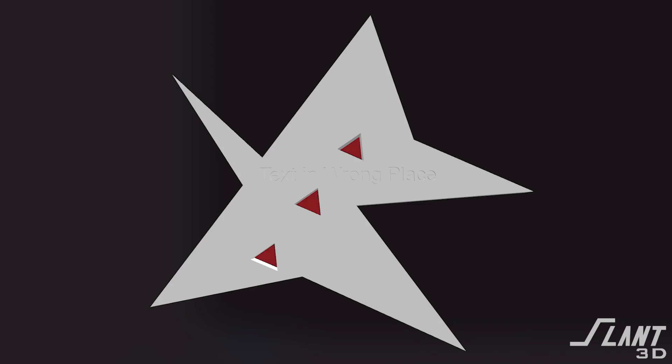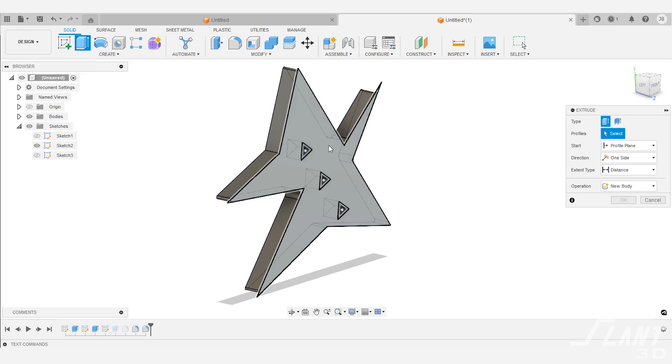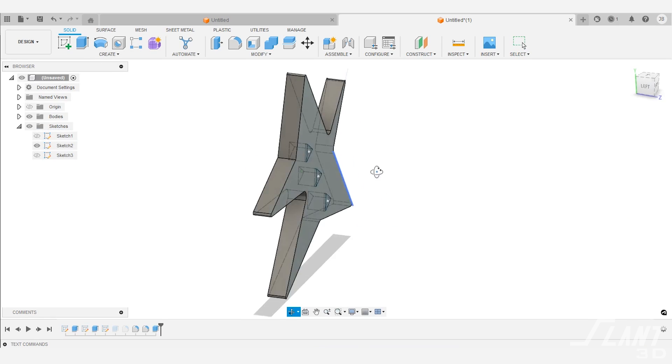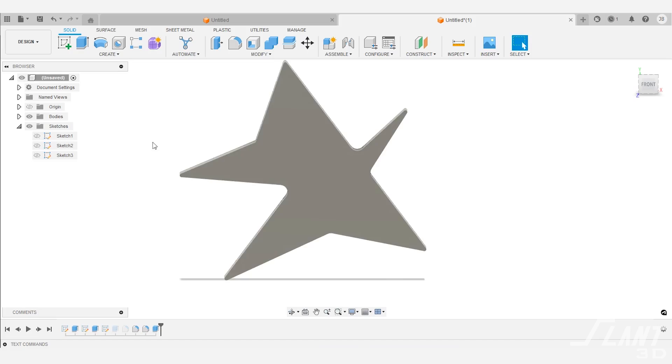Number one, it has those triangular holes. Not only are they sharp with sharp corners which can create all sorts of deformation on the first layer, they actually don't have to be here — these holes are cosmetic. If you have cosmetic holes or features, rather than sending them all the way through the part, instead embed them. This creates a nice flush lower surface and you no longer have those holes which can potentially be deformed and warped on the first layer.